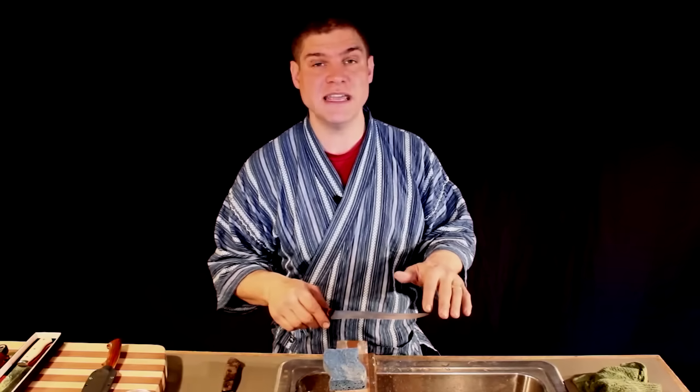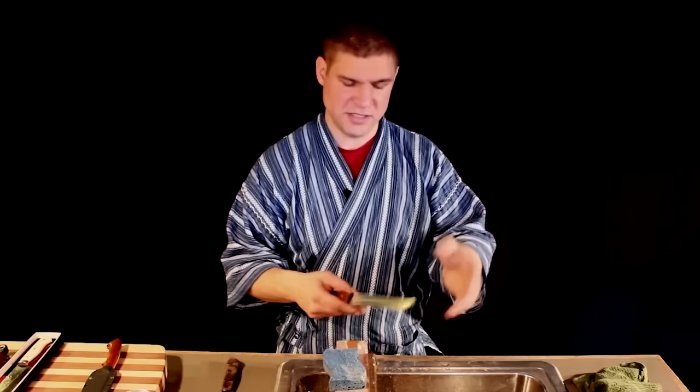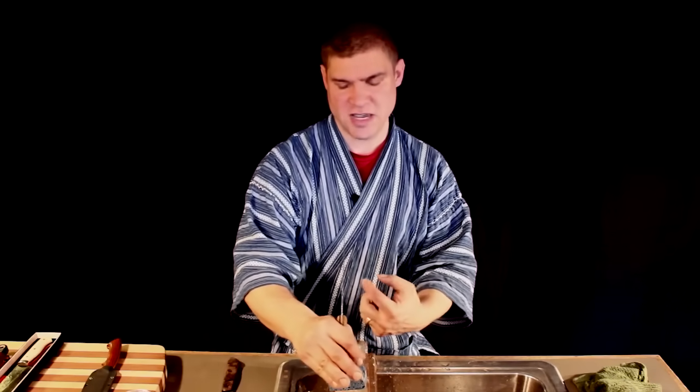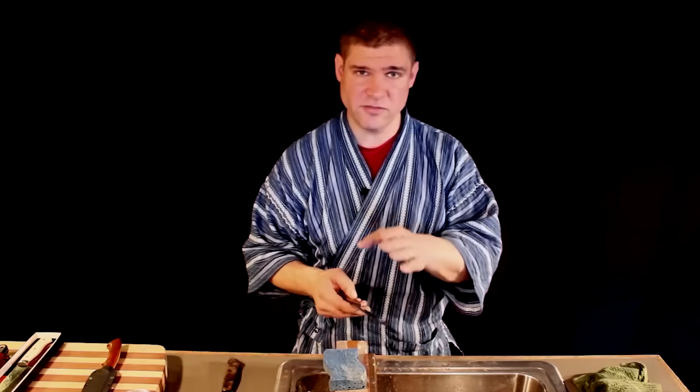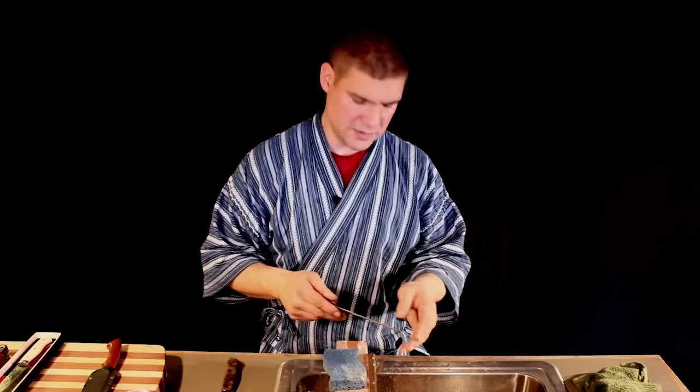So I don't just straighten it once. It gets straightened over and over and over again, especially as I grind metal away from one side of my blade and then grind it away from the other. Sometimes the stresses within the steel work different ways, and you can start off with a straight blade before you start grinding that secondary edge in, only to find out later that it's twisted a little bit as you relieve some stress from one side. So straightening is really important at Carter Cutlery, and it's important for you too with your knives. But we are looking for just straight within reason.